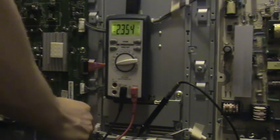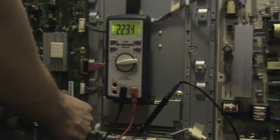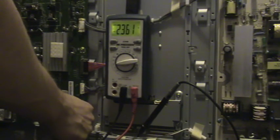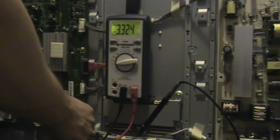Plugging it back in — and as I've noticed, usually when you turn them off and on they stop working. You can now see 2.35 volts. I'm going to apply freeze spray to this area and you should notice the voltage starts rising once the conductive freeze spray evaporates. Sometimes it may require the set to go through a reset cycle. There you go — 3.32 volts. Two green LEDs up here have lit up and the backlight should shortly turn on indicating the set is now operational.